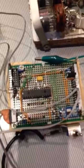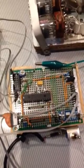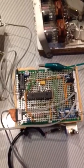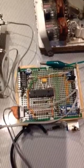It's the Mighty Micromite by Jeff Graham, a fantastic system. I'll go into it in more detail in another video, but suffice to say that all you need is the chip, which is a PIC32 series chip, and the yellow capacitor above it. That's it. The chip costs about 8 Aussie dollars, $6 US, programmed, and it comes with a full BASIC interpreter on the chip. The chip will hold about 2,500 lines of BASIC code, and it'll run about 30,000 lines a second. So it's powerful enough for this sort of thing, I guess.